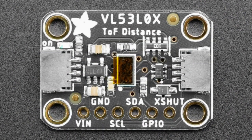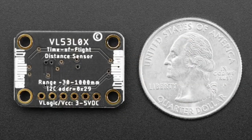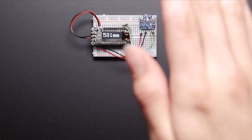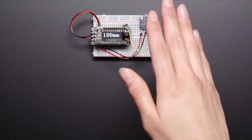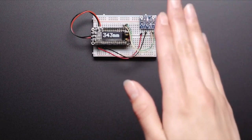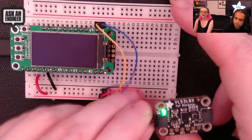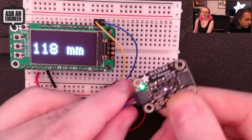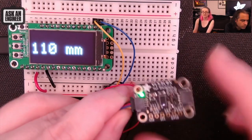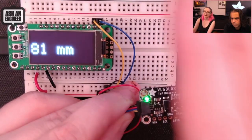Next up is an updated product. Our unending quest to STEMMA QT-ify all of our most popular sensors continues. This time it's the VL53L0X — this used to be breadboard-only, now it is breadboard or STEMMA QT. I'll show a little demo on the overhead. Same price, same schematic, same code, same everything. For distance sensors you usually want to mount them somewhere, so it has four mounting holes and you can just plug and play. It works with Arduino and we also have Python and CircuitPython code.